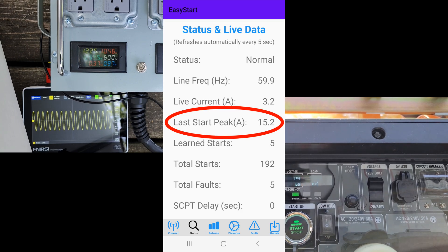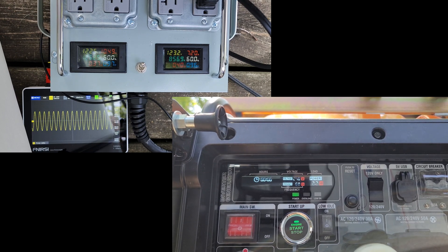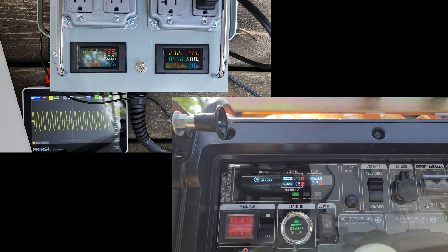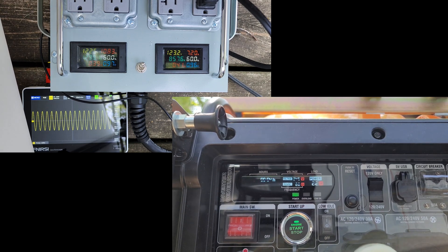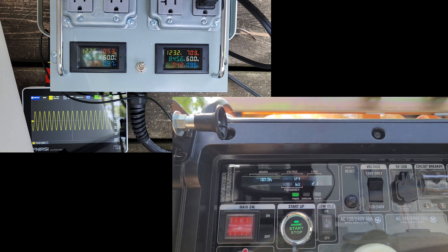The AC is running, and I'll pull the data log from the Micro Air app to compare the amperage readings against the meters on my distribution box and the generator meter. With the whole house running — television, refrigerator, lights, the air conditioner, blower motor, computer equipment — the whole house is taking roughly 2,100 watts, and you can see a clean 60 Hz on the oscilloscope. The GenMax does a pretty good job running a ton-and-a-half central AC unit that normally pulls 47-48 amps at startup. If you're interested in this type of content, please give it a thumbs up, like, share, and subscribe.